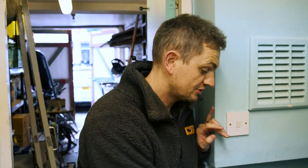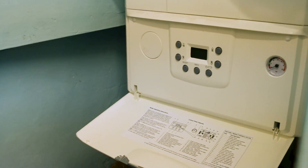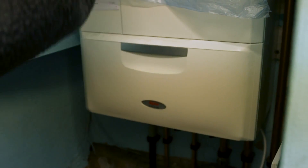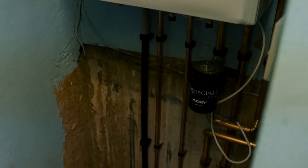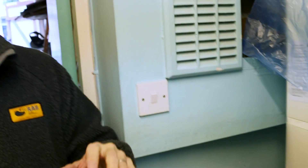This was the location of the old floor standing boiler, sited just there. Now we've installed this gas combi boiler — the e-tech 33H — which is the one that works with the hybrid system. We're going to have a vertical flue going through the same place where the old flue went. As you can see, all the pipe work here has been replaced and this boiler is now sited and ready for its flue. We've also re-piped the entire property.